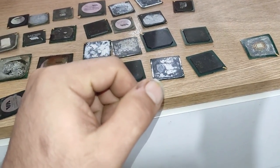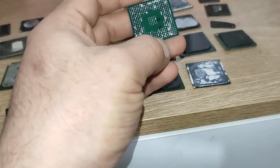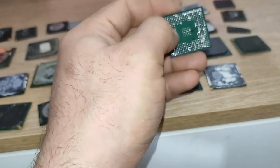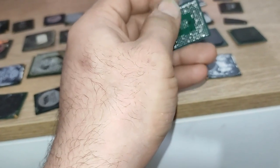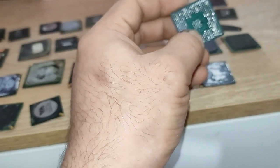To start, it's necessary to leach solder out first and get rid of tin. Usually the solder alloy of BGA chips comprises lead and tin, and in newer PCBs, they also use 4-5% silver. To leach solder out, you can use dilute hydrochloric acid. That way tin dissolves, and silver and lead chloride precipitate.